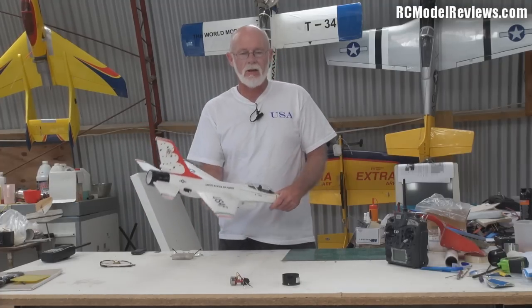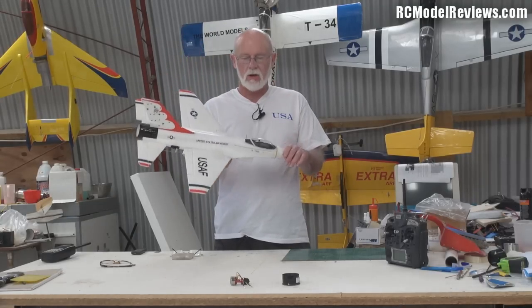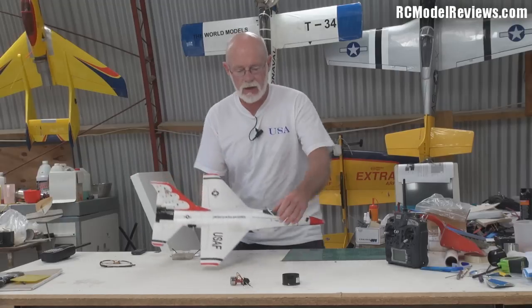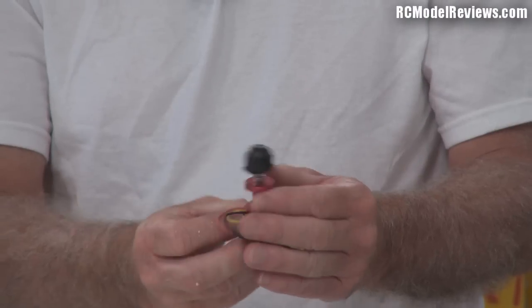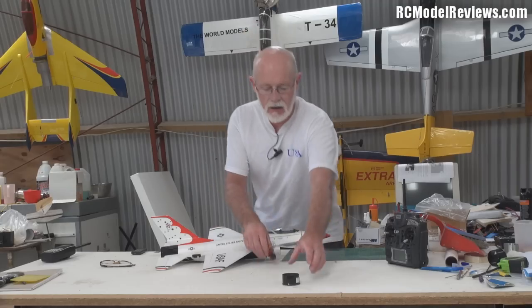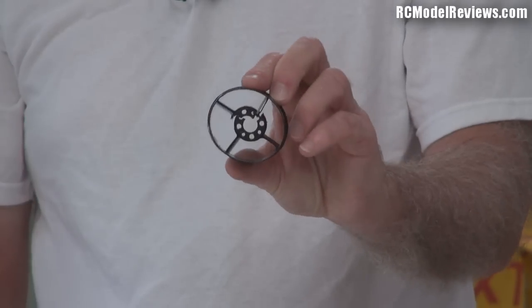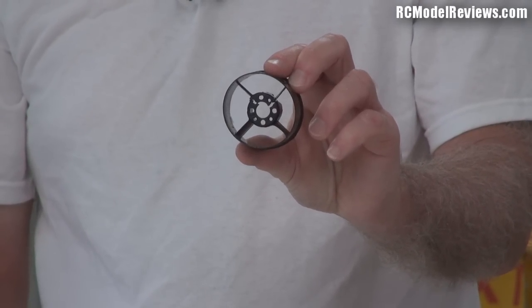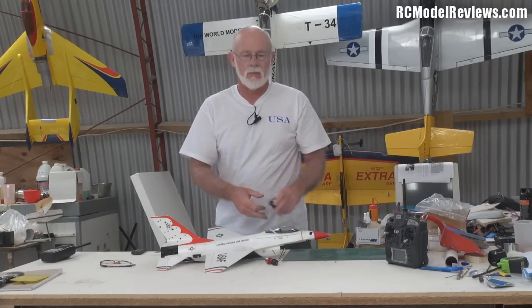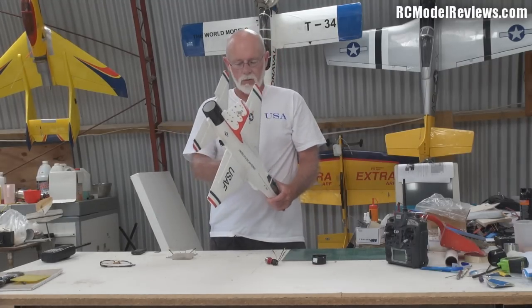Like a lot of other people, I had a problem. The little fan units in these are not the most durable, and mine grenaded — just completely blew apart. Here is what's left of the fan: as you can see, it has no blades, and even the housing had actually ovalled. I think that's why the blades may have failed — the pressure from the foam caused it to oval slightly, the fan started rubbing, and then all the blades came off. So that was the end of that.